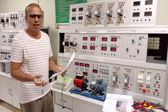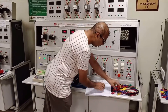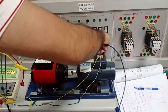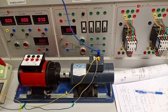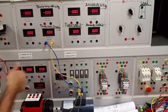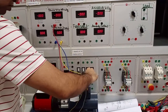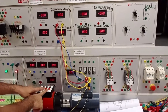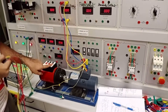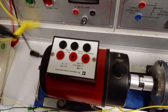Now we are going to perform the experiment and connect the wires. We need to connect the prime mover with the generator. The prime mover is a DC permanent magnet motor connected in series with an ammeter, which gives us the current and voltage readings at which the prime mover is being operated. Prime mover connections have been done. Now we have to connect the armature and the series winding on the generator — these two windings are connected in series.